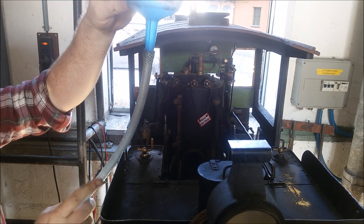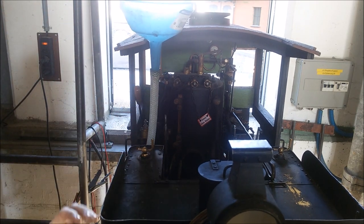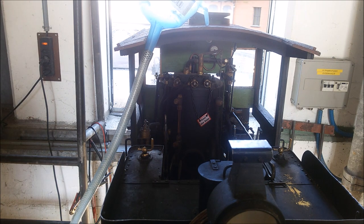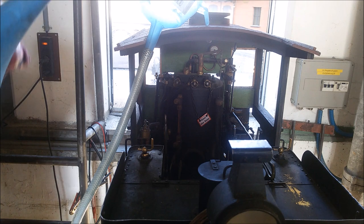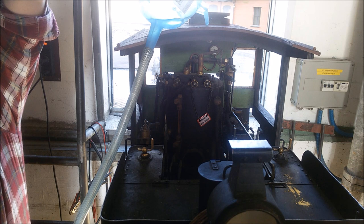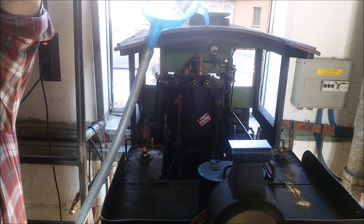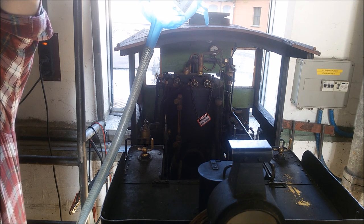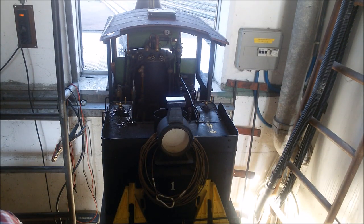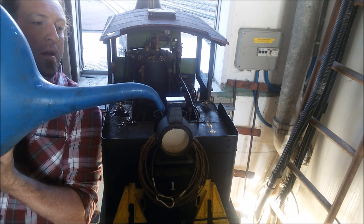While the boiler water level was too low, I topped up the boiler water by using the blowdown valve. The water level should be on half gauge level. The water tender will also be filled to provide a full tank when starting the first trip.